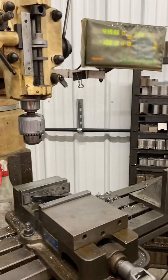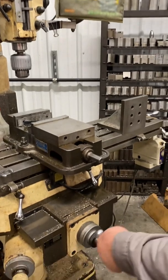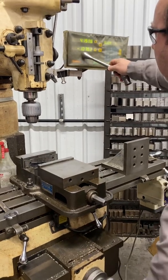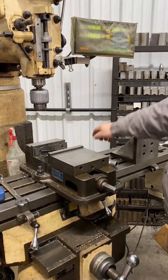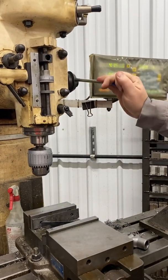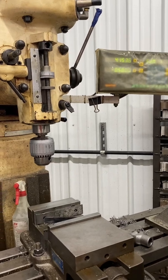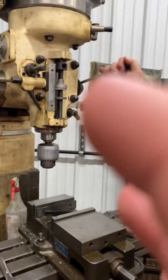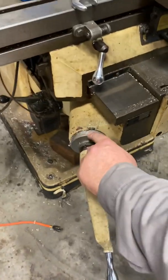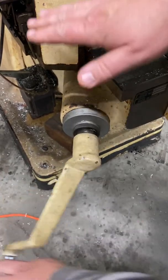Let's get back and take a look at the whole machine. What we have right here is a vise. You've got your X laid out, and here's your Y. Your Y does the same thing — as I crank my Y this way and that way, you can see the readout moving up there, just telling me how much I'm moving. Then you'll have your Z axis. Your Z axis is very similar to a drill press — it gives you a few numbers with graduates up here informing you about depth. I can move my Z either like this, or I can lock it in and come down here and move my Z more. Here's that dial again for the Z — moving it down if I want to make a spot face, or up. As I do the table, the whole unit will rise up or rise down.